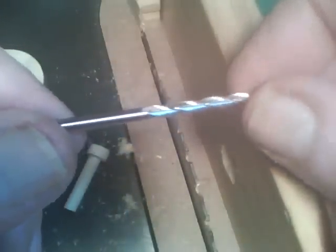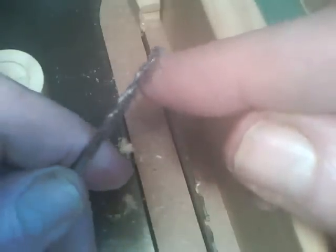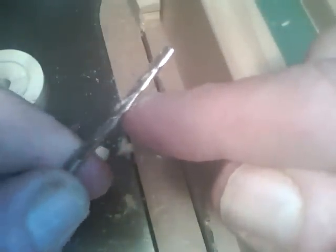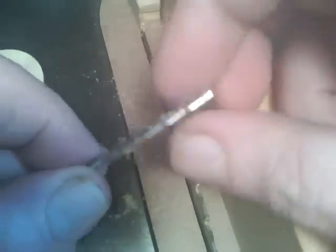As far as these bits go, I really like them. They're your standard Roto-Zip bits — the original ones they claim are only good for drywall — and they work just fine in the CNC. You can't push them that hard because they're high speed steel, not carbide, but these are sharp. And they're made by Bosch, so you know it's a good quality bit. Thank you, I hope you like it, and please subscribe to my YouTube channel.